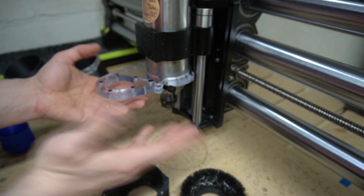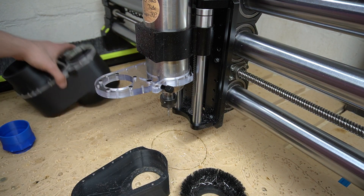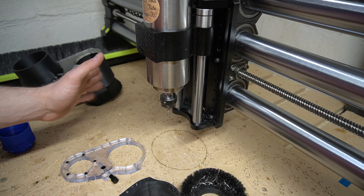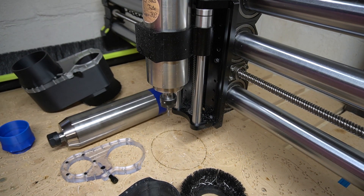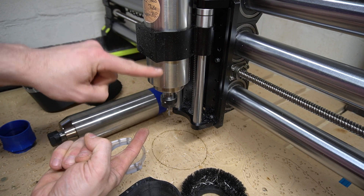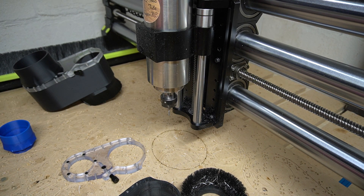It really depends — air cooled spindles, about 80% of them are longer down here where you can't actually mount to, so there are different size bottoms. This is a three inch bottom and this is the 2.30 bottom. My air cooled spindle is a round motor and it's very short and small. I also have a water cooled spindle that is extremely big relative to this area right here. I had another spindle that was air cooled that stuck out this far, which meant the only way I was going to be able to mount my boot was with the three inch bottom.